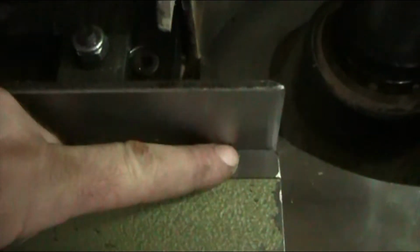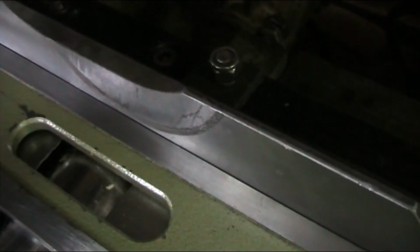Now with our ruler up here behind the second spindle, we've got contact right here. And then as we go along, we see a little bit of a gap here. And so now we need to close up these gaps. But we also need to check to see where we're making contact along this edge. And we're making barely contact right here, which we need to back this off just a little bit or bring this one out a smidge.